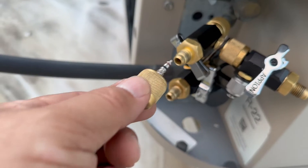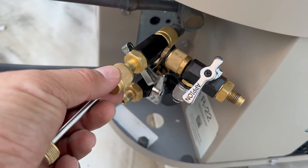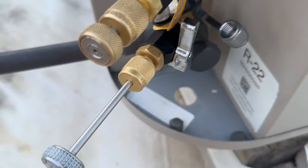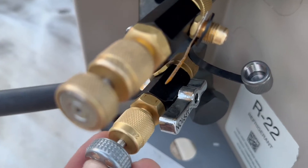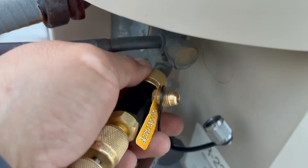Now we're gonna put our core back. I put the tip of the core tool right there and I'm gonna insert it. I'm gonna tighten this — screw it in. Now I'm gonna open this valve. Right now I cannot push it because the valve is closed, so I'm opening it. Now I'm able to push and I'm pressing in. It feels like it's right there. I'm gonna open up this side — no gas coming out, so I think that's it. Now I'm gonna remove the liquid line.